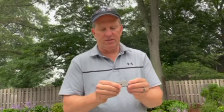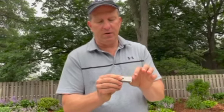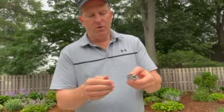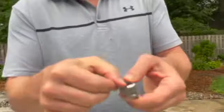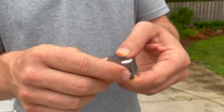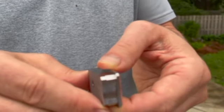When stainless is made, it starts out as a flat sheet and is rolled around. So a stainless handrail isn't as perfect as an aluminum extrusion. So when this guy pops in, we have to have lots of clearance room, and that's what these clearance cuts are for. Notice there's a little bit of a step, so when we push it in, it can get started and then get tapped in more firmly afterwards.